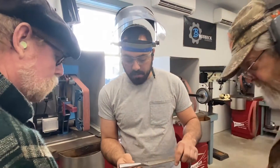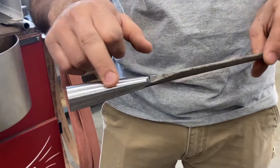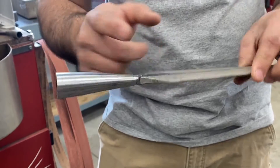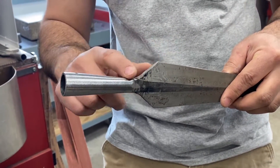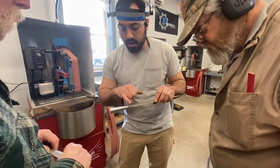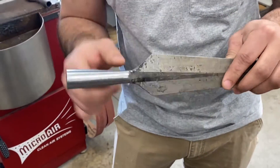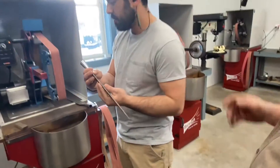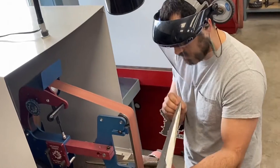So that's what I'm kind of going for here. I've blended it kind of close to where this transition is happening. And since I have it blended pretty close to here, I'm going to be able to clean this up either by hand or with the higher grit belt gently, probably using the wheel or the slack belt also. But this transition here is going to get a little bit thinner as it goes into the blade — I don't want to really mess with that just yet. So we'll go back to the grinding rest. Let's go.